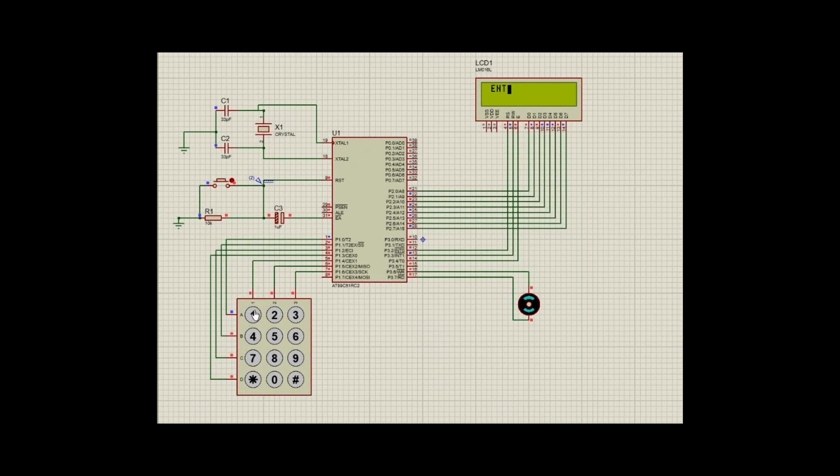After a while, the door automatically closes and gets locked. To set a new pin, enter the old pin (1234), then enter the new pin (5678). The system displays the new pin, and you must enter it again to unlock the door. The motor rotates, the door opens, waits, then the motor rotates anticlockwise and the door closes and locks.